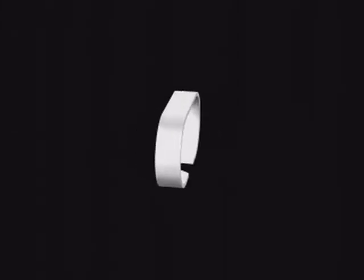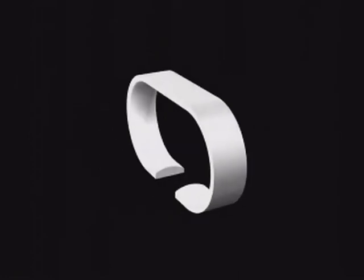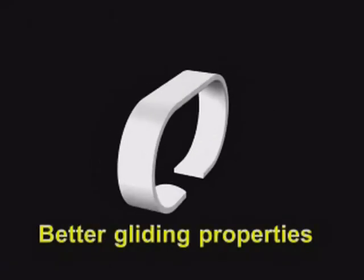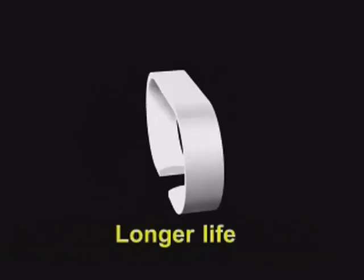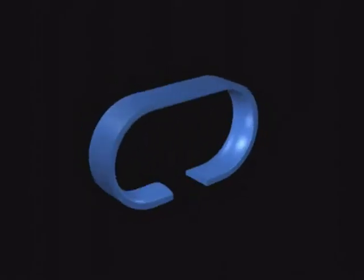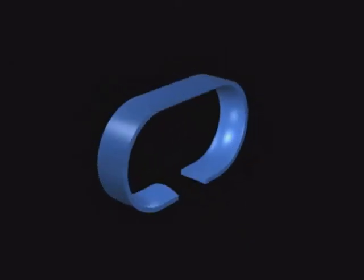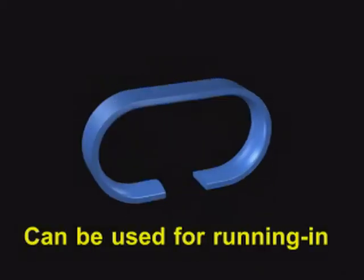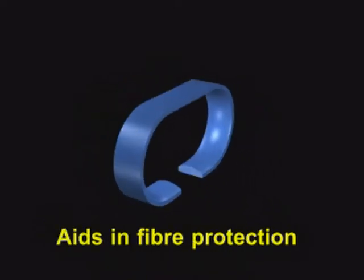High-tech Travellers are nickel-coated Travellers with special alloying elements added. Their advantages include excellent heat dissipation, better gliding properties, ability to run at higher speeds, lesser Traveller burnout, and longer life. Super polished Travellers can then undergo a special chemical diffusion treatment, where chemical substances penetrate deep into the base material of the Traveller, enriching overall quality. These can be used for running in and have better elongation for easy insertion.